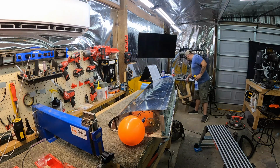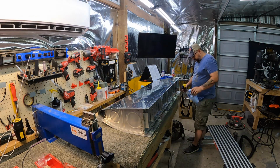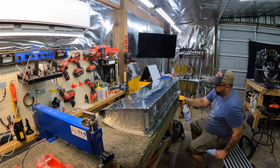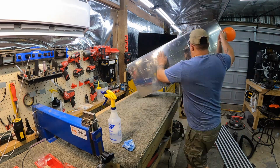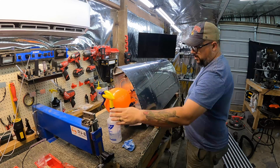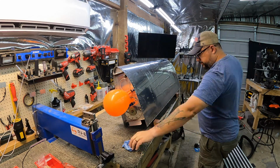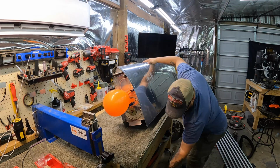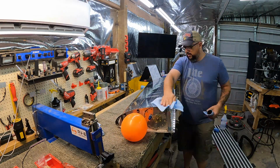The leak test of the right fuel tank. So far so good. Get the spray bottle out. Check the usual spots. Check all the new patches. Happy to say I don't see any leaks. So I decided to leave it inflated for as long as possible.